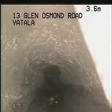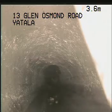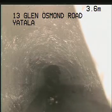Looking at the amount of breaks here, it probably wouldn't hurt to excavate from where that IOS is through to the steps and replace that section of drain right through to this point here.